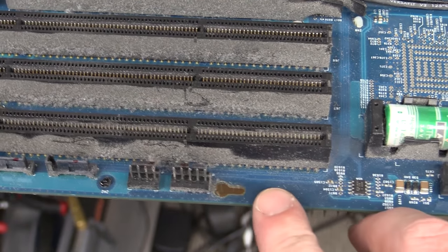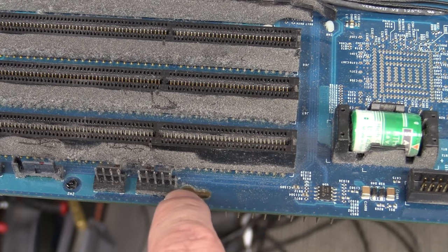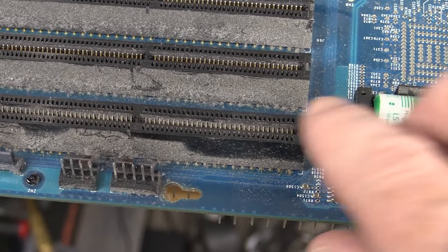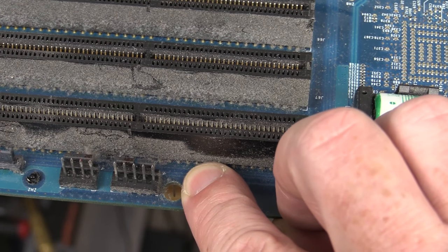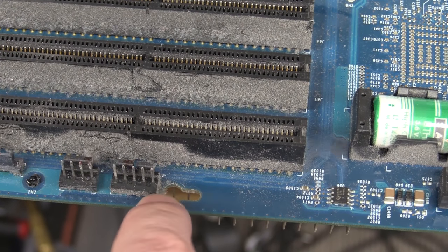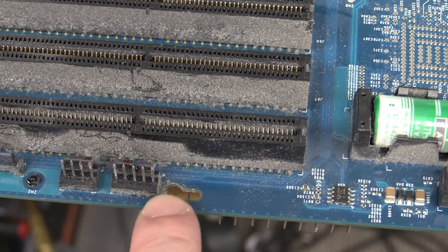Oh, yucko. Anyway, here's our key slots, and we can easily make those out. You could do that two ways. You specify either in the PCB, I'm talking about, a drill like that. So you specify a non-plated hole, and then you specify a slot, which is a hole with a dimensional length on it, from that point through to the center of that one.